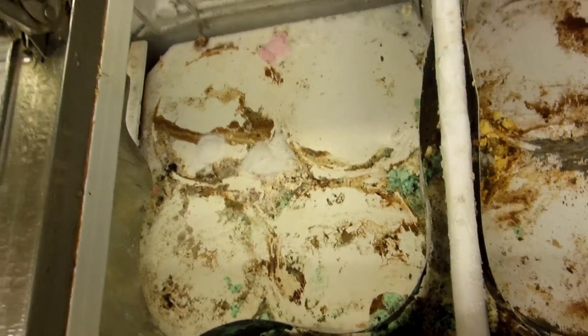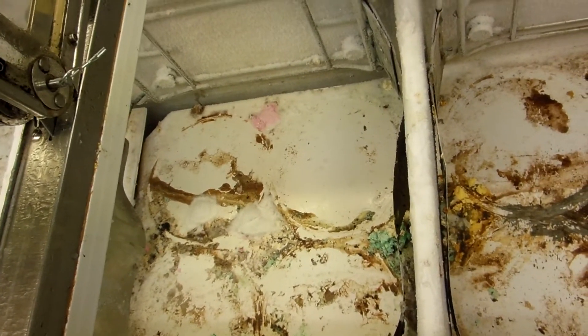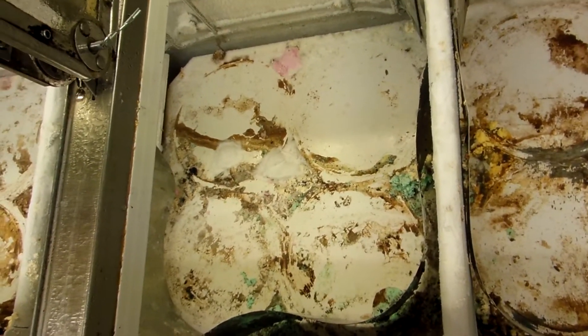What usually happens — how it happens — is these cases are old. When they defrost them, you just turn them off. So right now the units are running probably in a vacuum, or at real low suctions — in a vacuum or single digits or whatever.